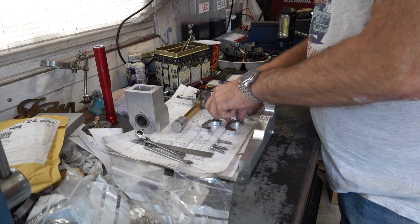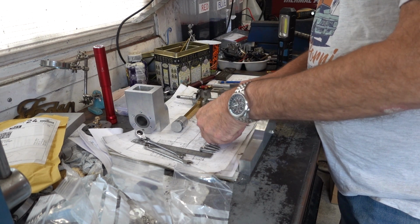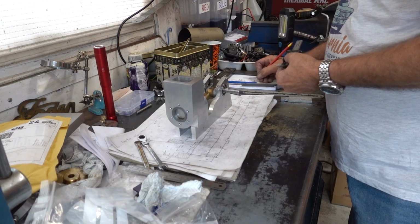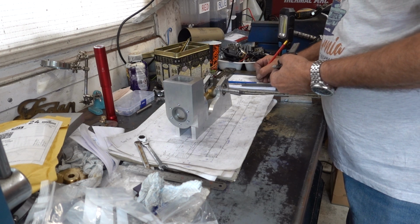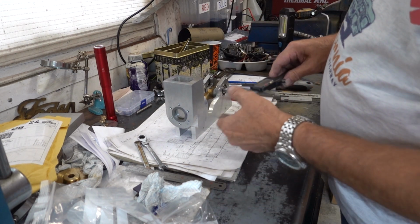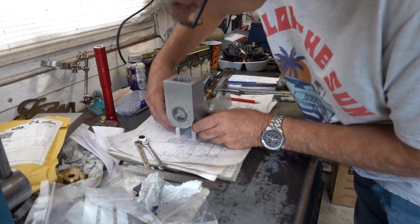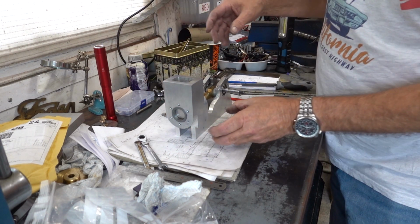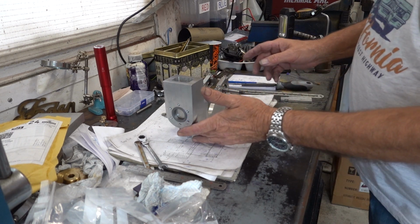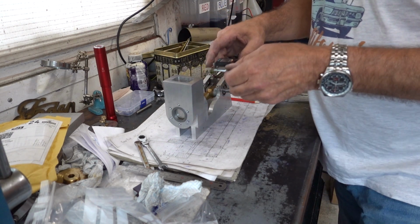Right, let's have a look. Yeah, better. The mic is 5. Good God. So, 5.38mm that. And I wanted 5.3. I'm going to call that as probably being okay. That's top dead centre. Flush with the front. Reality check.